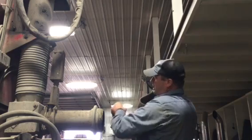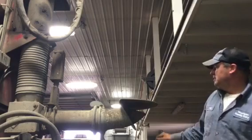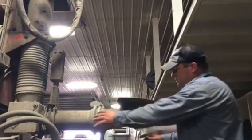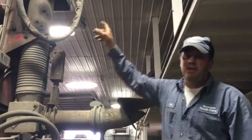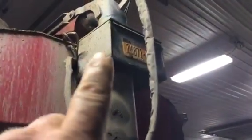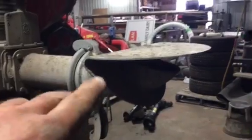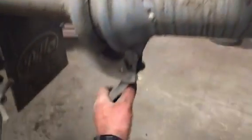So you decide to put your spread plate on — you get brave, you think you're going to be able to go on the field. This is the way I had it on there: you slide the spread plate on, bang, it's down. Putting the spread plate on down at the ground here, it's all easy. But picture things if you're way up top — you're leaning down on the top of the tank. You're going to want to just set the spread plate on there and have gravity work its course to kind of hold it in place, then grab your cam lock handle and lock it in place.